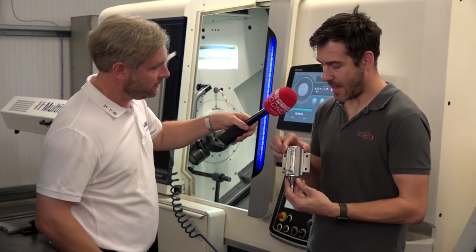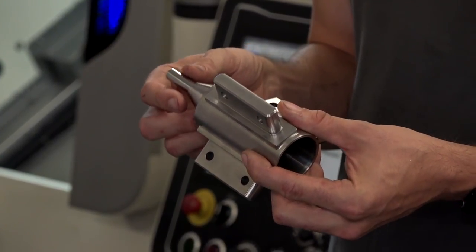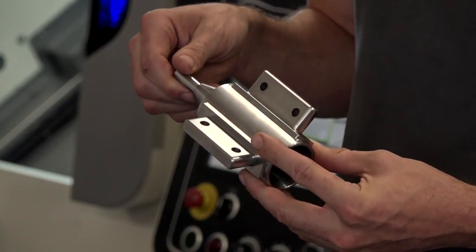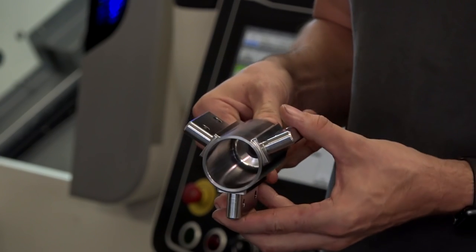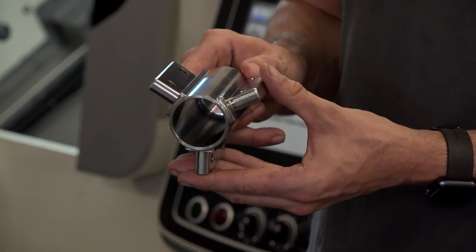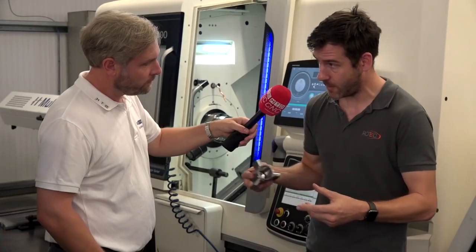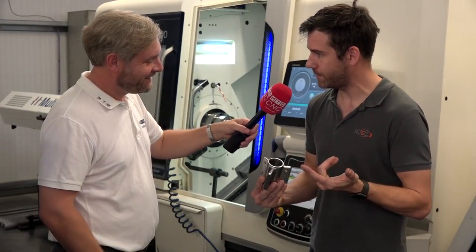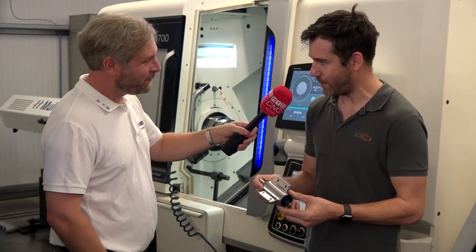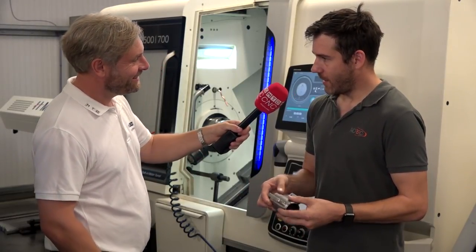This part — what's it made of? I believe this was 316 stainless. Looking at it, it's really complex in terms of radiuses. Talk me through it. We just broke it down a bit on the CAD. There's a nice turned section at the front, then a lot of milling. Rough it all out with just one tool, then minimise tooling and finish it off with another. Use a small ball nose to blend in the middle sections, then chamfers with just a drill. Pick up, take it away, then back to a turned section where we bore out the back. Although it looks a horrible part, put it together with a CAM system and all you're doing is putting a couple of tools in, load a billet, get on the controls, and away you go.